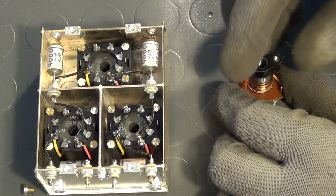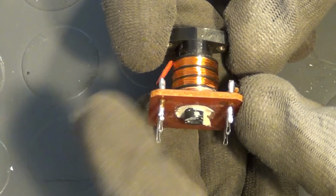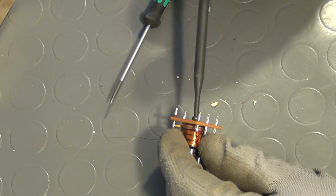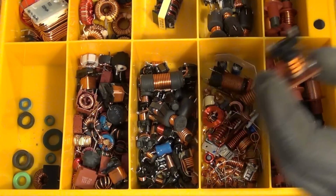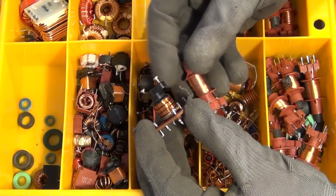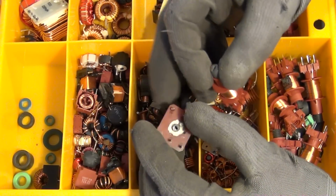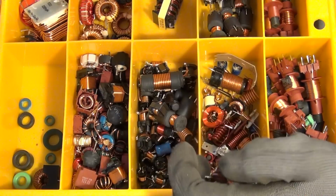These are again adjustable inductors. This is a more typical example though, where we have no brass screw, but a threaded ferrite core that can be screwed in or out, preferably with a plastic rod, as I have mentioned before. These coils are somewhat similar to the ones I used about 1.5 years ago in my RFID projects. Again rare, but useful components that are quite hard to come by.